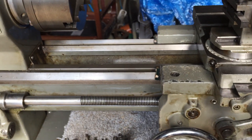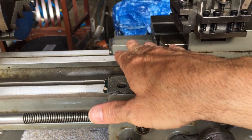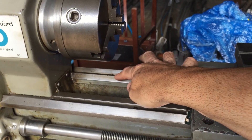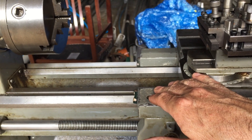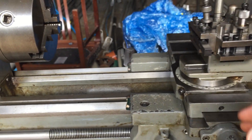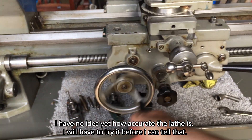The ways look okay, but there's a couple of little dings. The carriage is quite large, so it's always going to be here where the work is spinning that gets damaged most. But hopefully, because the carriage is quite a large thing, it kind of averages out any little dings. So hopefully those little dings aren't too big a problem, and it seems nice and smooth.